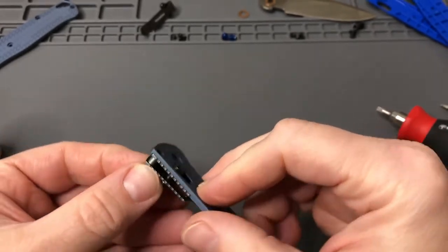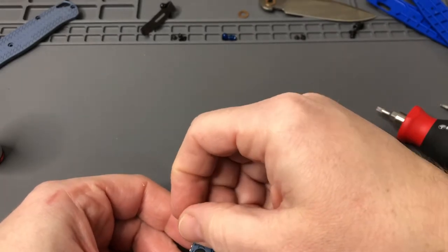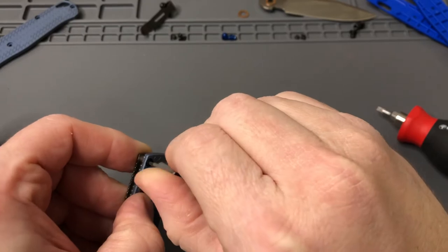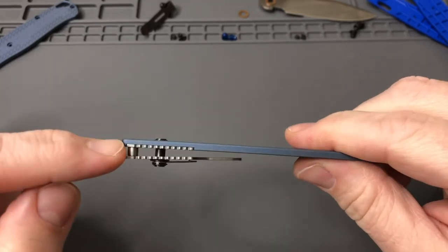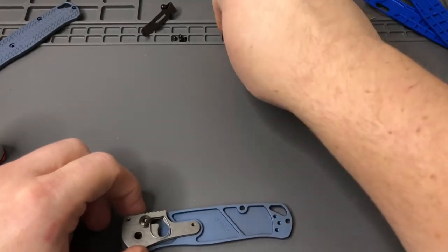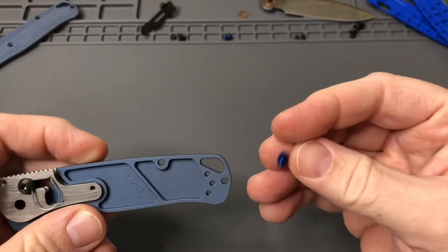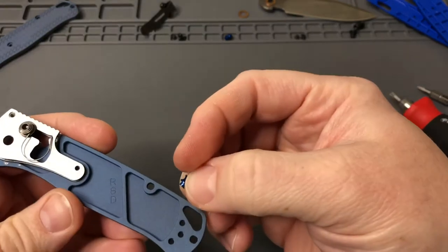You can see how that stuff's already milled out right there. One of the things I like to do is drop one of these screws into here and just set it with a couple threads — that just helps keep it in place while you work on it so that liner stays lined up. On his scales he's also got them milled out more in an oval shape, so the square parts will stay just like intended and those back spacers won't move.